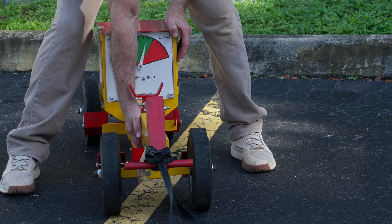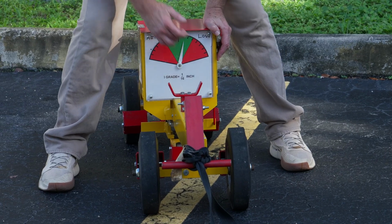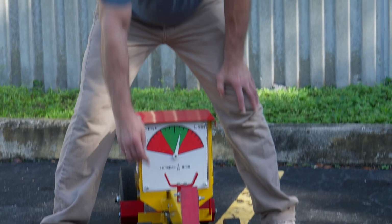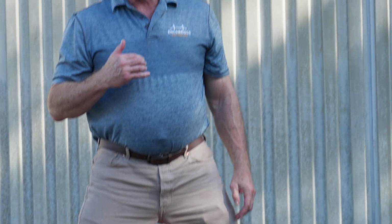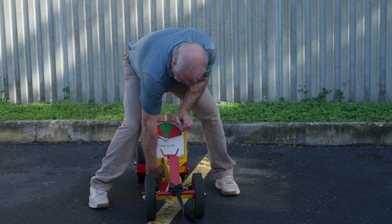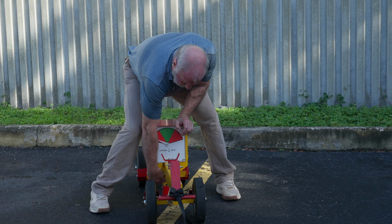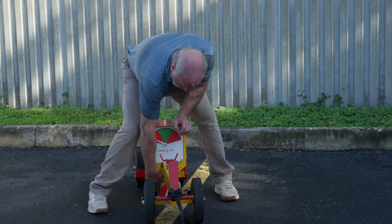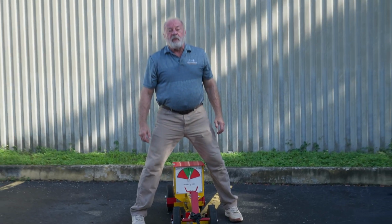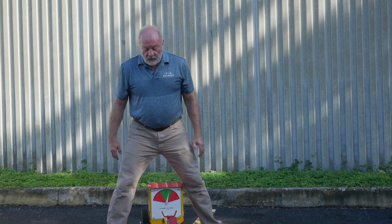And I'll just do it like this. You can see when I place the shim under my front and rear wheels, my center wheel is showing that the deficiency would be low. Once I've done that, I will go back and put the shim under the center wheel, and then it would show a deficiency that's being high. Once I take it off, it should go back to 0. Now again, we're on a pavement that's not level, but this is just for training purposes only.